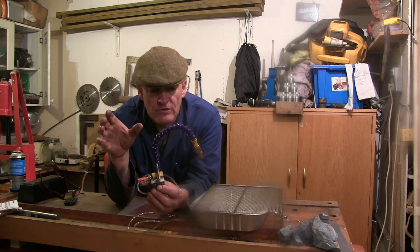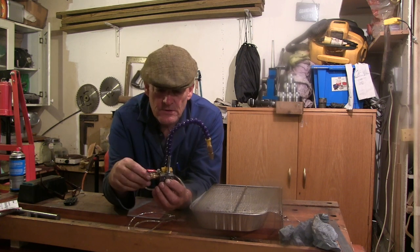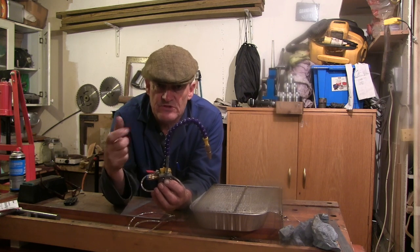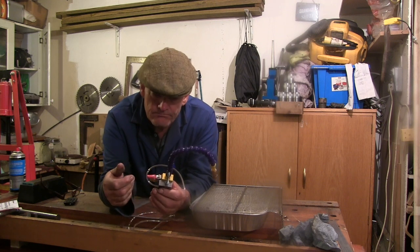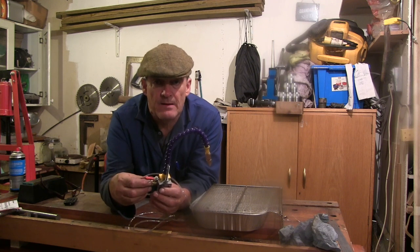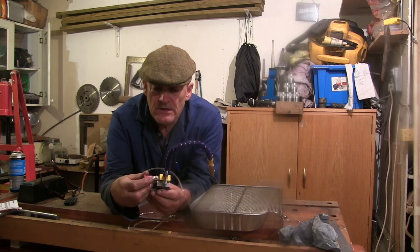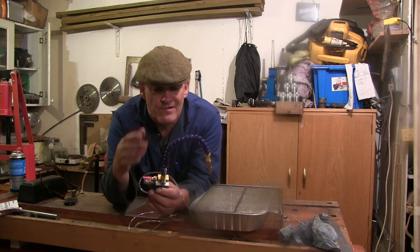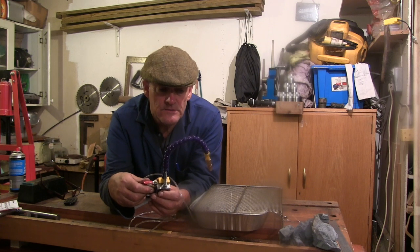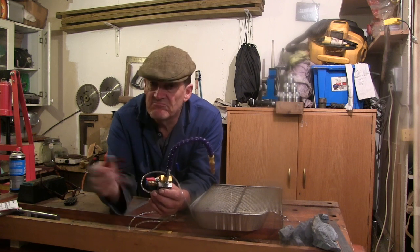If you use quite a strong clip when you're using it in the drip feed mode, just after you've put a bit of air in there and got the siphon going, if you just clamp it off properly, you can just switch it on and off basically with a clamp. Works great for me. Now, I've never had a lathe with a proper suds pump, so I've got no benchmark, but this works great for me. Doing them cones where it used to get very hot and I used to have problems with it, this sorts that right out. And with a drip feed with the rear tool post that I made for parting, it's a dream.